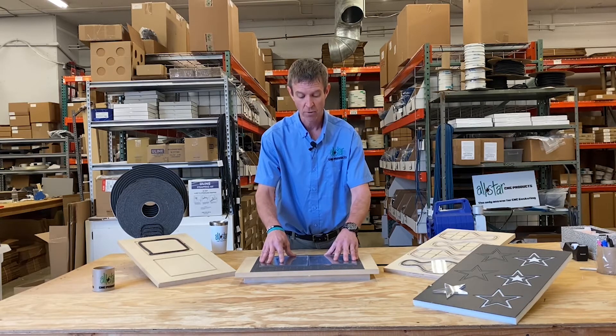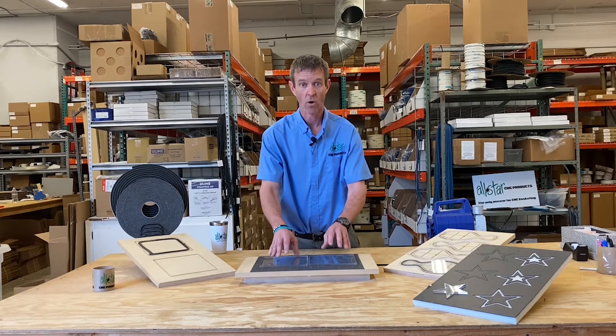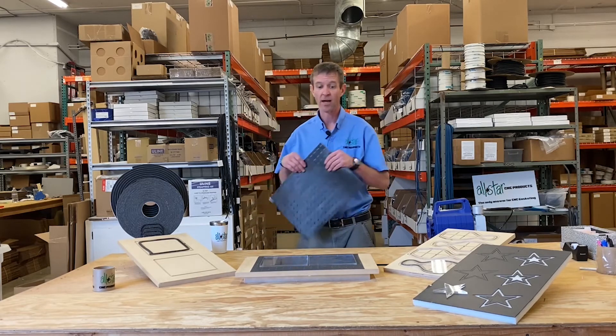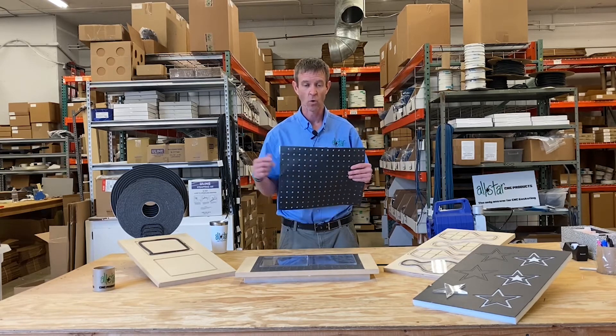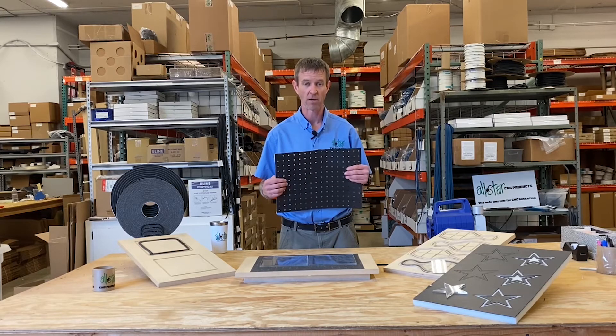The second advantage is all those suction cup holes create the same kind of vacuum clamp system that an onboard gasket would produce, but now as mini suction cups. Over 4,600 of them on a 4x8 table produce tremendous vacuum clamp ability. For those long, narrow parts — trying to prevent onion skins and tab cuts, trying to get finished parts in a single pass — the tile gasket concept is a great solution. It comes in tile form so as one tile starts to wear, you can replace it one at a time versus resurfacing the entire table.